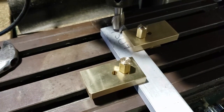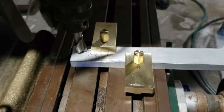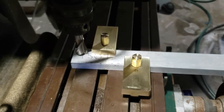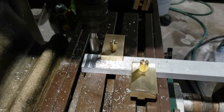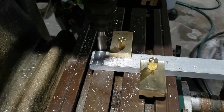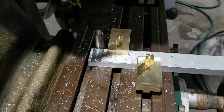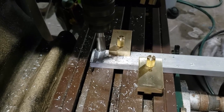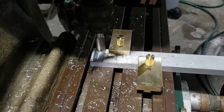Now what I need to do before I put something on here that I don't really want to replace if I mess up — I put a piece of bar stock in here using two clamps, got it all squared up. What I'm going to do is test passes to see how much I can remove, see how much vibration there is. Basically this is an expendable piece — just the tail end of a piece of bar stock — so it's not a big deal if I lose a couple inches off of it.